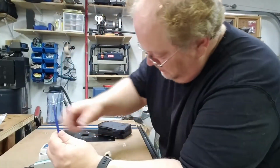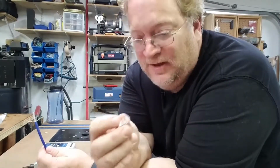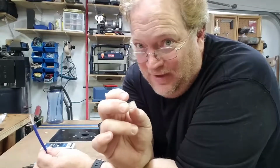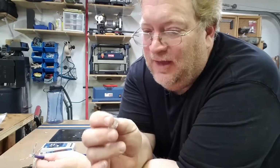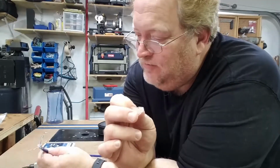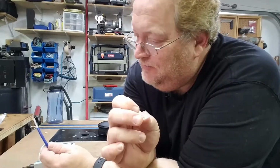Okay, now we're going to wire the plug end. Make sure you've got the plug end type that matches your type of cable. Category 5 and Category 6 use different plug-ins. You can use a Cat 5 end on a Cat 6 cable, but it won't be proper, won't be certifiable, and it's not as likely to run at full speed like you'd want it to.